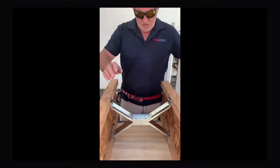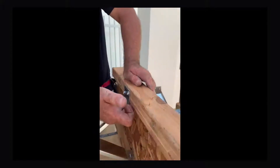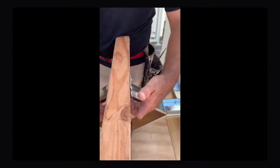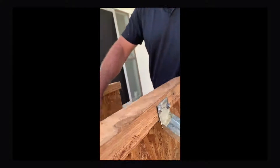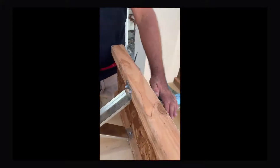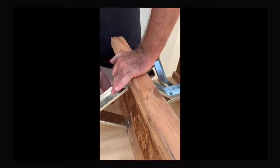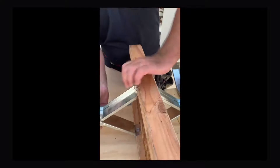Once this is installed, because it's locking underneath and you come around on the other side and do these directly opposite each other, it's basically a cradle supporting the joist. All the load goes back down onto here and reverts back into the other joist and so forth until you get to a solid wall. It's putting pressure against each other, so in a fire, if the web burns out, the weight is still transferred onto this point here and so forth.